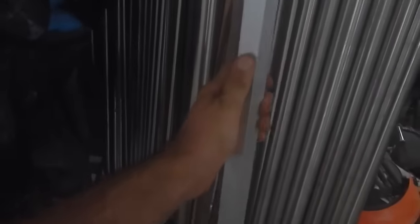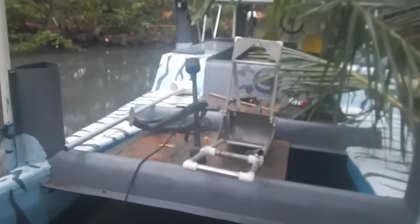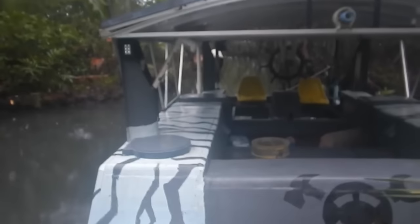I have lots of stainless steel round pipes. I also have aluminum square tube. The square would be a nice shape for this. Much easier to attach things. Am I gonna have a problem with the aluminum and corrosion? I used that square tube on this here boat. These parts here would be splashed by the most salt water and they looked 100% fine. All these ones up here, they're pretty well protected anyway.